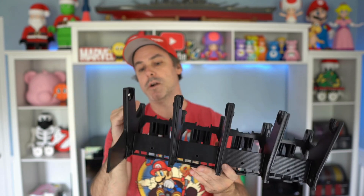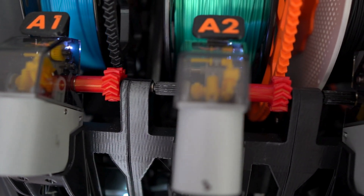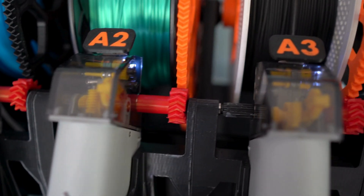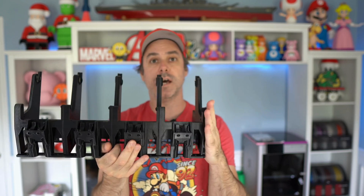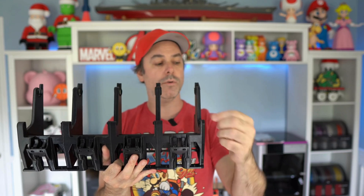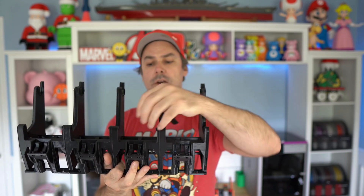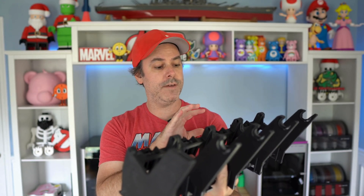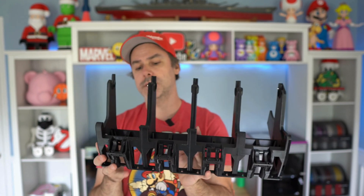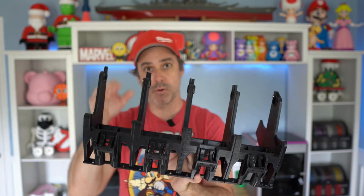Since we've started on this side, you're going to pull off each of those feeder gears — those front gears — using one screw, starting on the right side. So if you're looking at it, you'll start on this side: unscrew it and pull that gear out. The reason is that each screw is hidden by that assembly, so pull each gear out in sequence — that pretty much frees up everything. You can leave the feeder motors for two and four; I didn't find they were in the way.